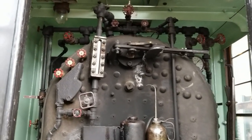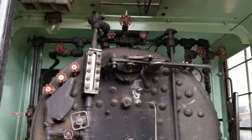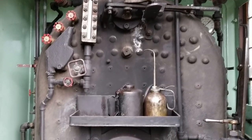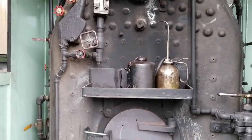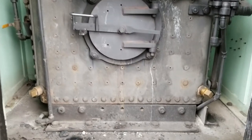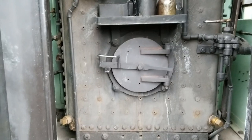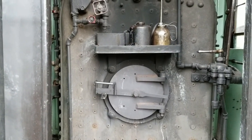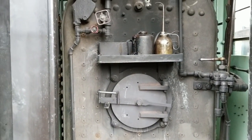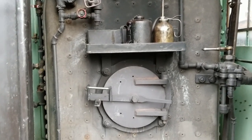What we'll also do is take out all the plugs. Some of the valve bonnets we'll take off, get water out of the valves, and take the injectors off. Drain the water out of the saddle tank. Open up all the washout plugs. Get inside the firebox, clean all the ash out of the firebox, clean all the ash out of the smokebox — and generally get her ready for the freezing weather.